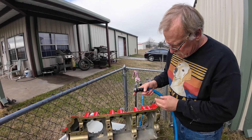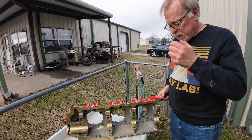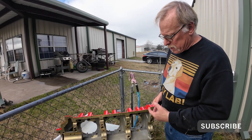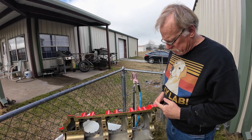What we're going to do is show you the lube sequence on this. We're going to put water into it. We're rinsing this case out — it's getting ready to go together. We're making sure there's no media in here, making sure all the galleries are clear and all that. So we're doing a final water rinse, then it'll be blown dry before we assemble tomorrow.